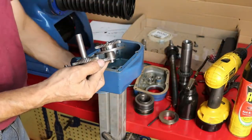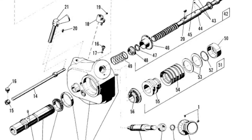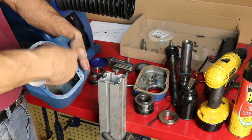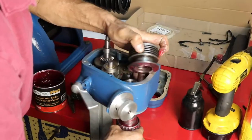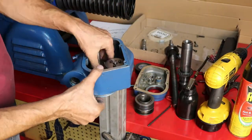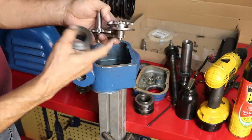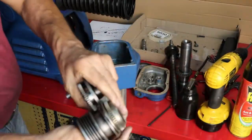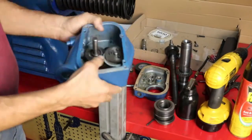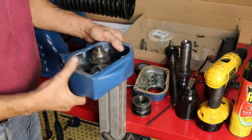This is the variable drum-fit gearbox assembly. This unit is a pain to put together. Although the manual with the exploded view will indicate the position of the pieces, it does not tell you what to put together first or in what order. The point of this gearbox assembly is to vary the speed using a Belleville spring and compress two sheaves or conical washers — taper washers — sandwiched between the spring and the disc. Kind of like a clutch, but you can force the clutch in and out of the conical washers to vary the diameter as a sheave, without the belts. It's an EMCO trademark automatic feed. So when you turn the dial, it changes the speed mechanically. It's very hard to put together the first time, although once you figure it out, it's no big deal.